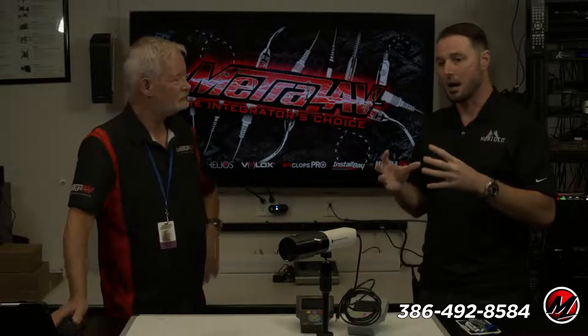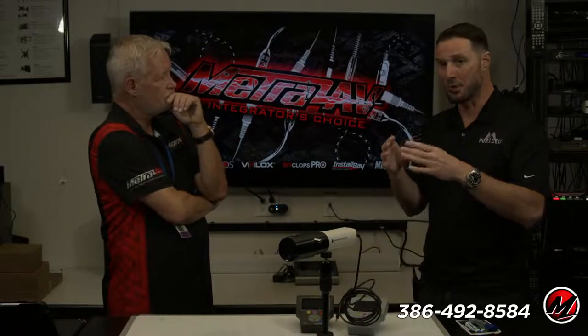So I've been down this road and listened to you. Exactly. So as human beings, we can see a very specific bandwidth of energy, and that's what we call light and color. When we talk about TVs and cameras, we look at certain color gamuts. Color gamuts are predetermined specific shades of color that are used in video systems. So for example, when we started off with NTSC color, there was a very specific color gamut called Rec 601, and it was very small. And then in the 90s, we went to Rec 709, which got a little bit bigger. Now we're dealing with Rec 2020, which is huge, but we are running into a limitation right now with the physical capabilities of displays. So we've kind of fallen into a middle ground that's bigger than 709, but smaller than 2020, and that's what's referred to as P3.